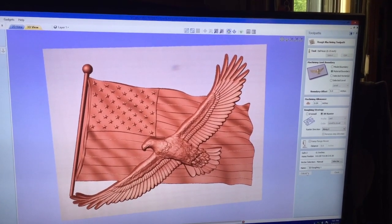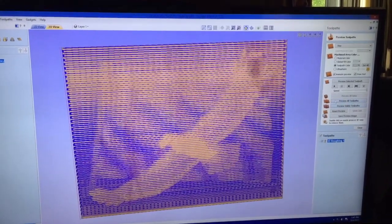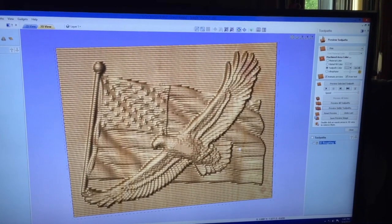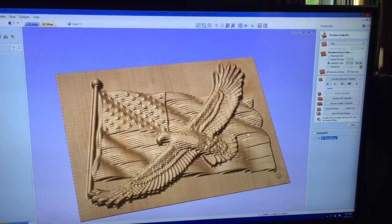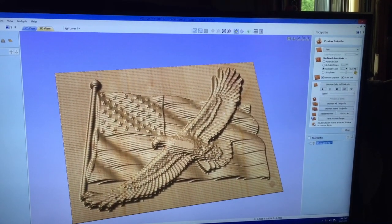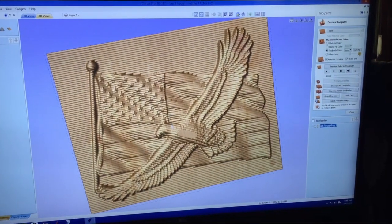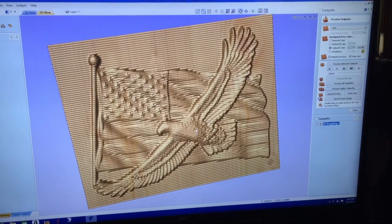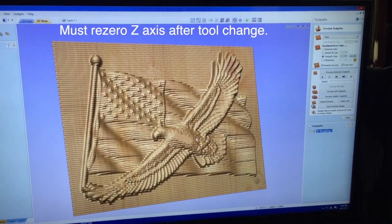It takes a little time — I've got an older computer. You can see the bar across the bottom. Then I'm going to preview this toolpath and see what it looks like. There's another video — I'll put the link at the end of this one — that shows how I zero it to change tools. Right now I'm done with a quarter-inch round-over bit and I'm going to go down to a one-millimeter bit, so I've got to zero it again. This shows a little area here that's left, and that won't be left when it actually machines — there's a little discrepancy, but that's okay.